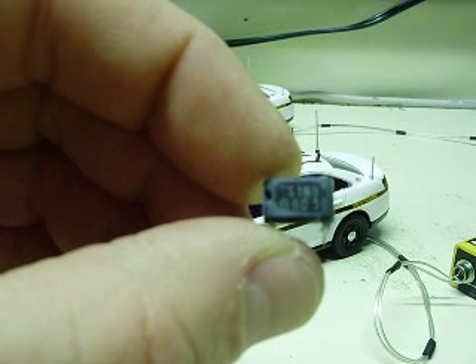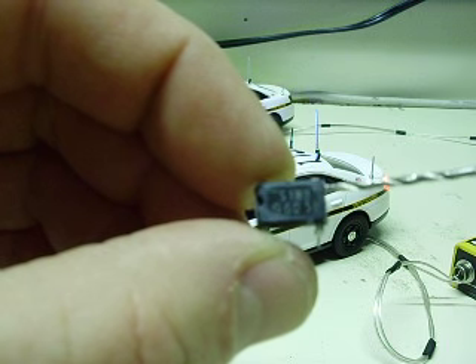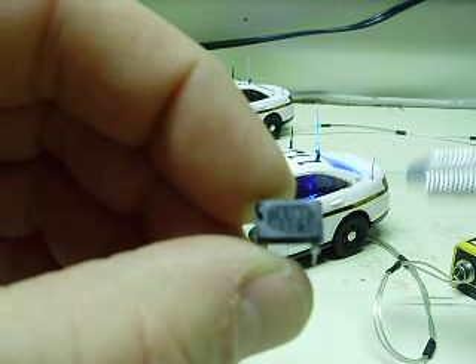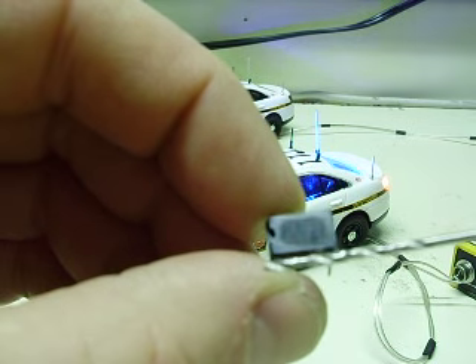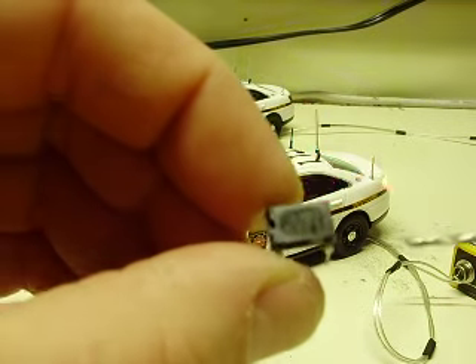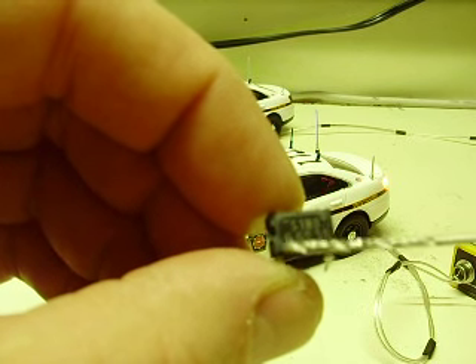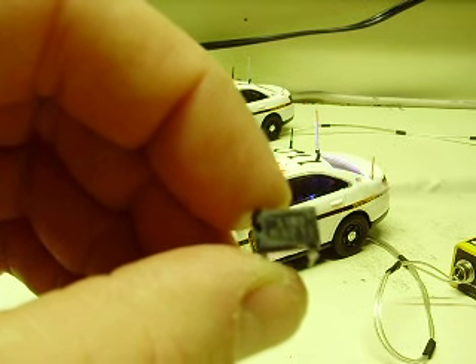There's four legs on this, and you'll see here there's a negative mark and a positive mark. Those two would go out to your LEDs, so you'd still have to observe polarity on your DC side. On this side here, usually there's two sine waves. A sine wave — for those who don't know — is like an S laying on its side, which kind of represents AC power, which is what comes out of your wall.